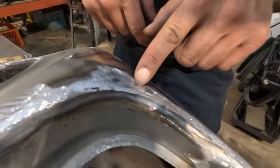Here's a trick Jordan from Bennett's Customs loves to use. I don't use it as much as he does, but I really do like it for certain things. And this is where you actually leave a little bit of the sandpaper and you leave it a little jagged, that's totally fine. And you allow these corners to be a little flexible, right? Because it doesn't have the backer against it. So the beauty of that is that when you are getting to areas like we're about to do, this will flex and kind of take the curve. Like this is a bit of a random shape. Doesn't matter, because its job right now is to use the corners, and the corners will turn up and make a nice blend. So yeah, that's what I'm doing with that.